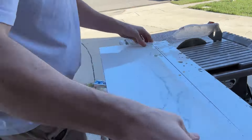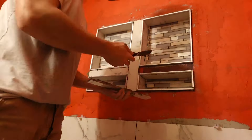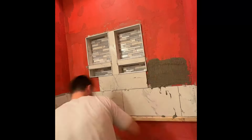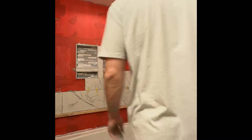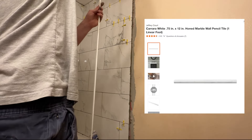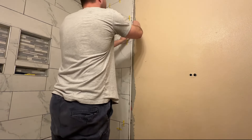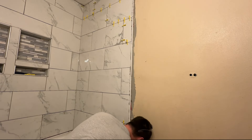When I go through and cut tile, I always seem to break it and have to make multiple cuts, wasting a ton of tile. One nice thing was that we chose a bigger tile, so there were fewer cuts around the niches and different parts of the shower — I think having a bigger tile made it a little bit easier for a first timer. To finish off the edges of the tile we used wall pencil tile, which is a bit pricey — a cheaper option is the aluminum trim we used in the shower. You can apply it after the tile is already there with just a little bit of thinset.